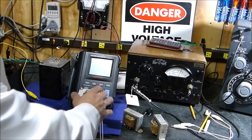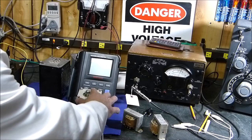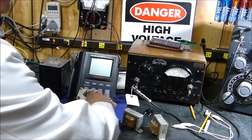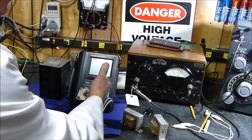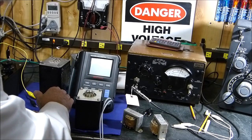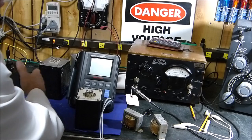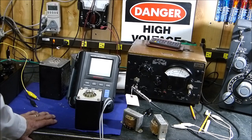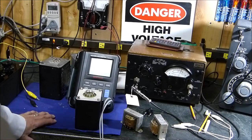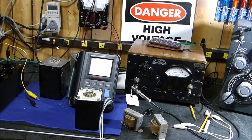And it basically works. Or if you had your 8-ohm tap out here and you put a 16-ohm load on it, you doubled it. See, in one case I'm halving it, in one case I'm doubling it. It's going to do the same thing back to the primary, so you're going to end up with a 16,000-ohm primary load back, what your tubes are going to see. At a ratio of 2 to 1, you can cheat it, and I think you can get away with it and have some really good success. Once you go past that 2 to 1 ratio, you're in trouble, because it is not linear.